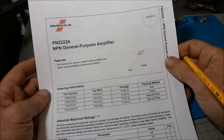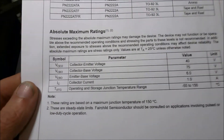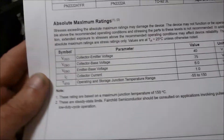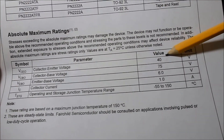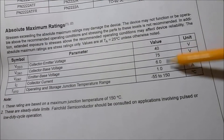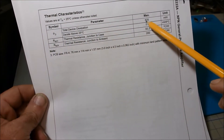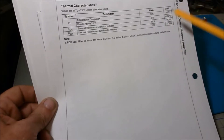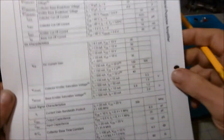To start off, we need to know some things about our transistor. These are the maximum ratings — we're looking at voltage and amperage, and we're not going to go anywhere near those. Another thing to be concerned with is total dissipation: this one is 625 milliwatts. We're not going to be in that neighborhood either. If we get it biased correctly, temperature shouldn't be an issue.